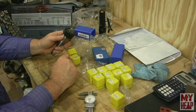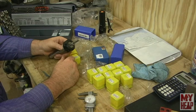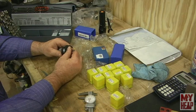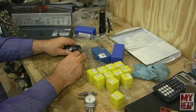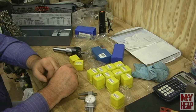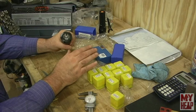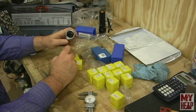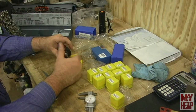So I went through all the collets using drill bits. A quarter-inch ball mill from my CNC router goes in there just fine, so the earlier issue was a non-issue after I dug into it. I could find no swarf or anything inside the slots where they were cut. They all seem to be ground about the same. The only thing I can say is I think the collets are probably okay. The chuck has about two thou runout in the taper, and that shows up on every test I've done, at least close to the chuck.